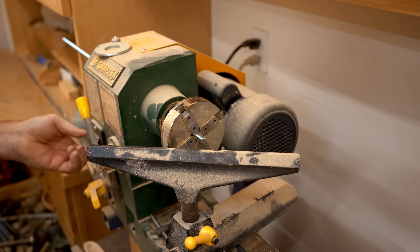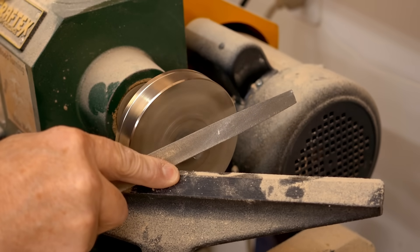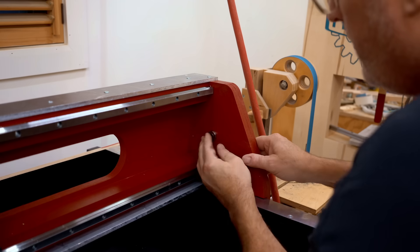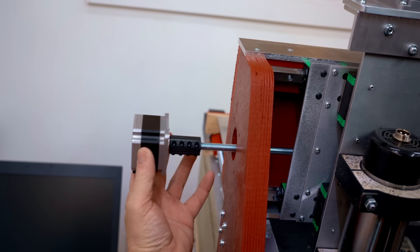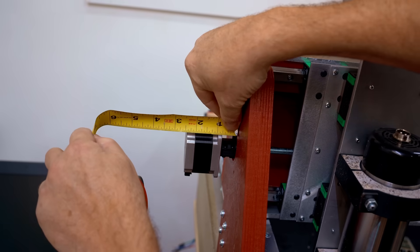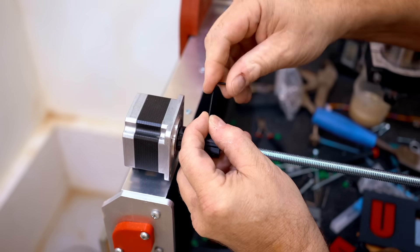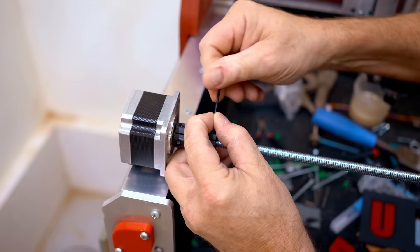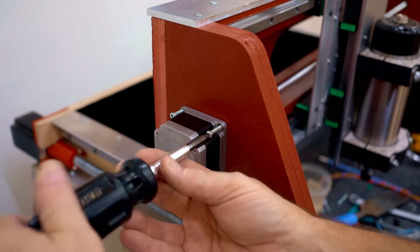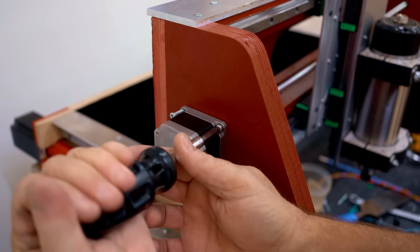I'm using my woodworking lathe as a metal lathe to turn down the end of the lead screw for the x-axis. I'm doing it on the lathe because this one is a lot longer and it would be much harder to do with it mounted in the cordless drill. With that done I can get it installed — the motor on the end is just to measure the length it needs to be. I cut it long and now I know exactly how much to take off to make it the right length. The coupler for this axis is the same as the one on the z-axis. The heads on the screws for the motor are a little too big, so I'm turning those down with them mounted in the drill. In the next video I've got a lot more details to clean up, but we are close to the end of this build and seeing it make its first part.